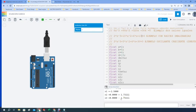Yes, it is stable, but it's a critical stable. Critical stable would be the answer for this one, because the real part is 0 on the imaginary part, but then the system will oscillate forever. So in other words, if this polynomial shows up in something you're doing in process control, the system will oscillate forever. It's critical. The oscillations are critical. That's what they call it.